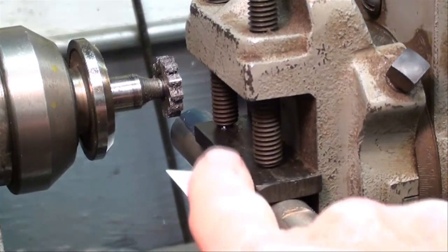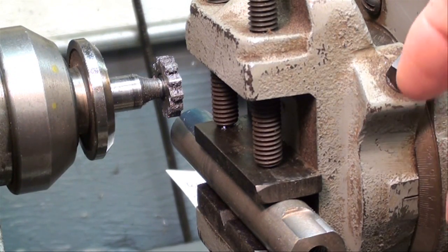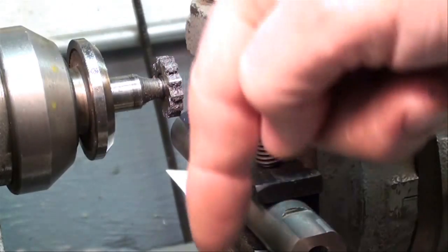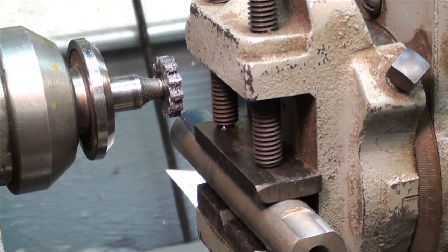That's just one slight difference. We also have to determine the depth of cut of the Woodruff key cutter, and that is done by looking it up in a machinery handbook or some other handbook that would show the dimensions of Woodruff keys.